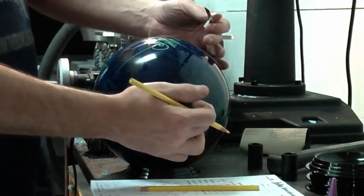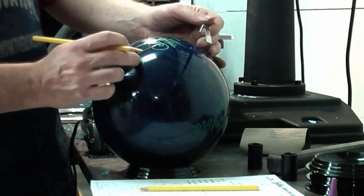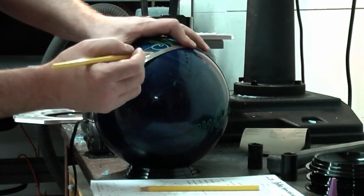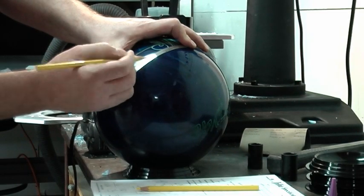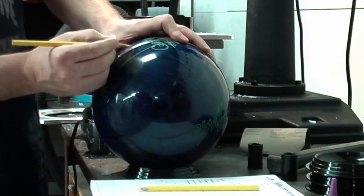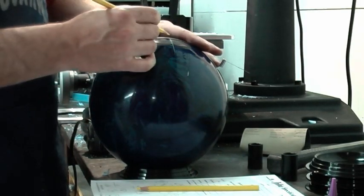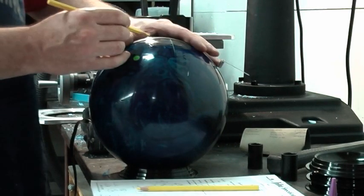Now what I want to do, because it's almost like using a protractor, if you swing this out, it's going to arc out. If I extended that line exactly perpendicular across, that span would actually be a little too long. So I want to mark a spot over here, 4 3/8 of an inch, and then a spot over here, 4 7/16 of an inch. So it's two points across. Now I can just take my ruler, lay it across and connect the two dots.